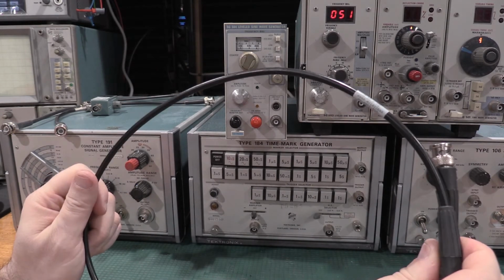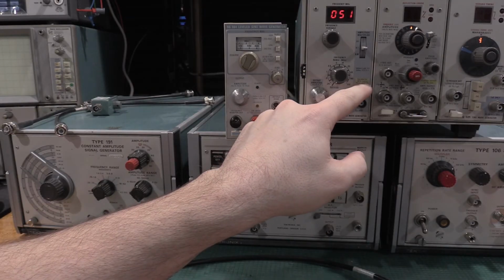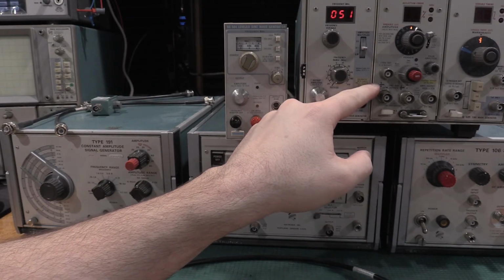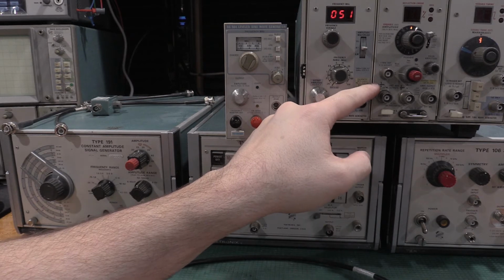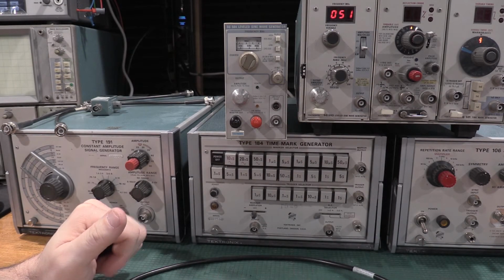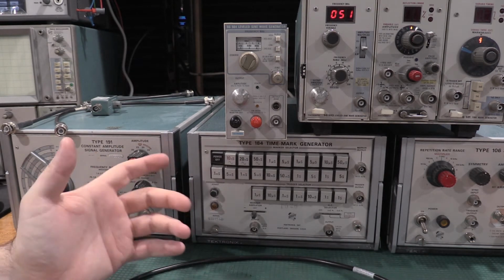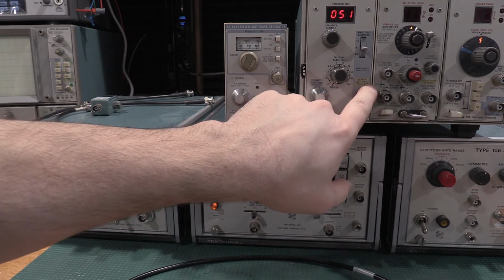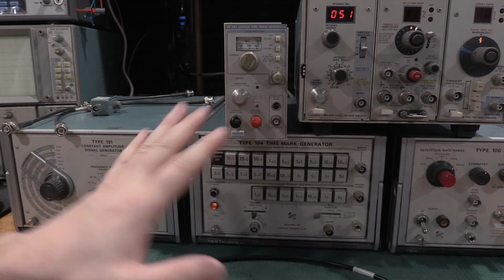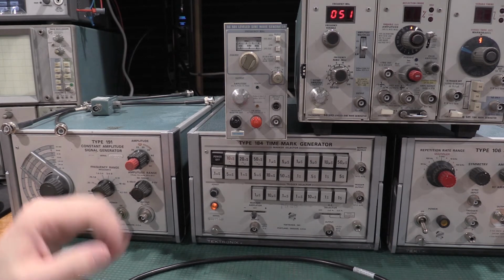It's the same part. Same thing's true for tubes, transformers, and other things. If the main numbers are right and the very last two are up or down, should be an okay part for what you're looking for. Maybe not down, definitely up. You could replace a -00 with a -01 or a -05, no problem whatsoever, and everything should be good.